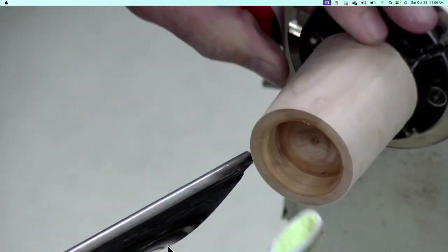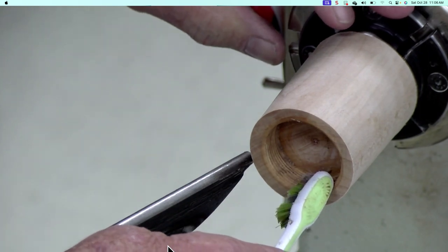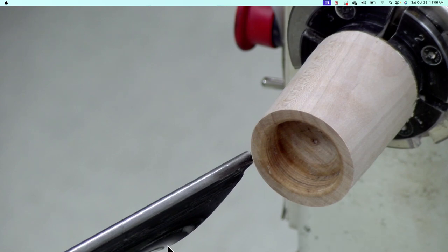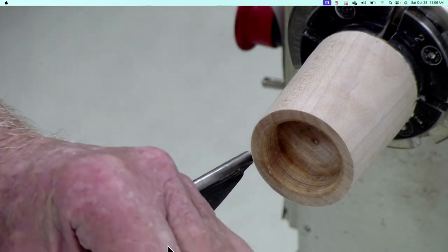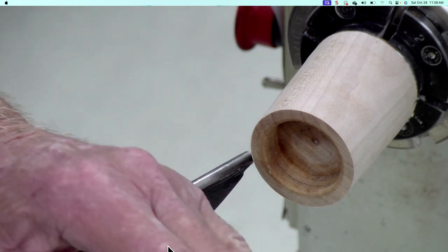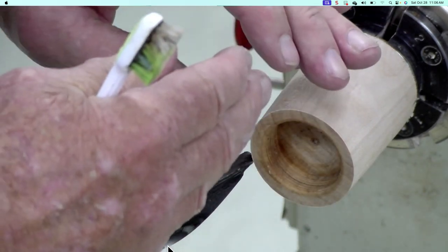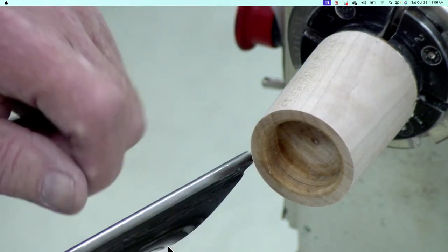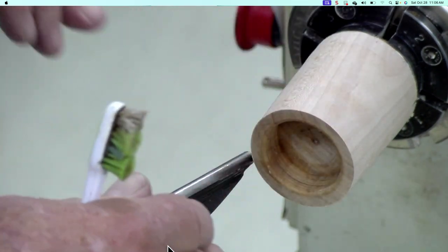If you're using a jig, do you still have to maintain that slow speed on the lathe? No, no. On the jig, the cutter head is spinning at a pretty fast rate. It could be 1,000 RPM. That's a cutter. And what you're back here cranking, you're cranking at 16 TPI, if that's the TPI, and you crank in, and it goes in. And then I stop it and pull it out, and then crank a little more.